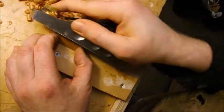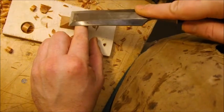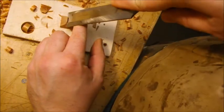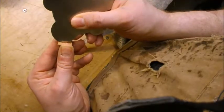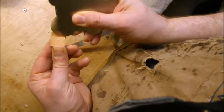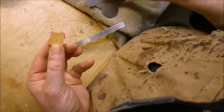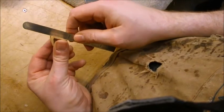I'm making it a pyramid shape because that seems to be the most structurally sound from an engineering standpoint — it spreads the load out over a wide surface. Then I'm very gently scraping the surface that contacts the side slightly hollow because it's curved, and that gives a place for the glue to go and it just fits nicely.